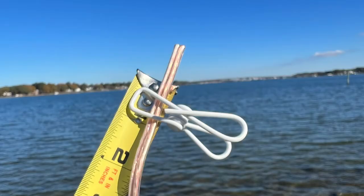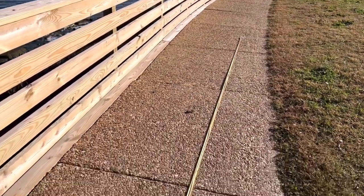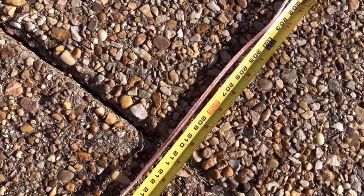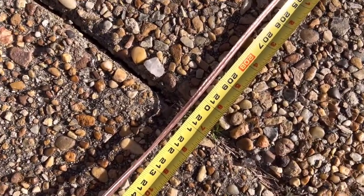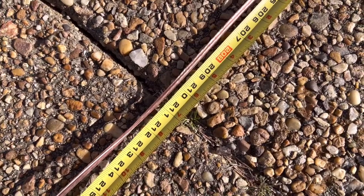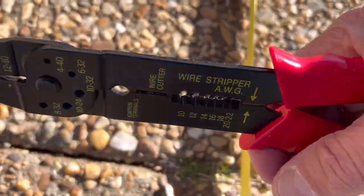I've got a clip at one end that holds the wire. When working by myself, I usually cut about one inch or 25 millimeters longer than needed, because I'm going to strip that end for the connection point. I stretch it out, find my spot, and cut. For us that's at the 210 mark — that's 17 and a half feet, or 5.33 meters. Nice cut. As you can see, speaker wire is two pieces, so when I buy 100 feet of wire, I've got 200 feet.